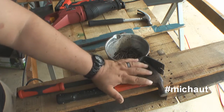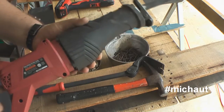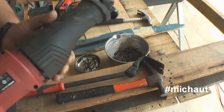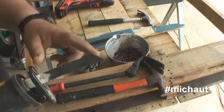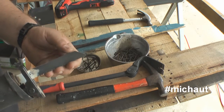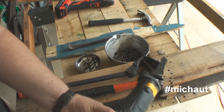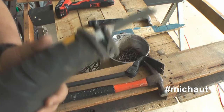If you don't want to spend an hour and a half taking apart a pallet, you can go with the Sawzall, which is the next most popular option. It truly is, as one guy put it, just like butter — it will remove all the nails from a pallet in about 10 minutes or less. A lot of people advocate getting an extra-long blade. The sides of the pallet are easy, but the middle board is so long that you can't reach all the nails without that extra-long blade, which is the reason they recommend it.